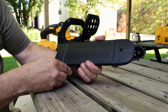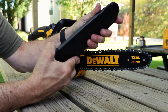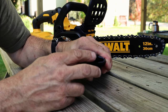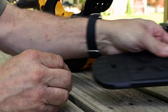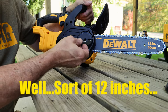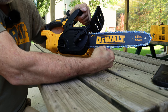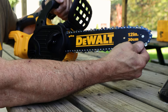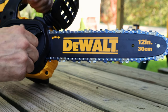The scabbard, as I said earlier, really seems to be made tough. The inside of it, you can see it's ribbed, and I think the ribs are actually to retain it against the bar. You got a 12 inch bar. Here's your chain tensioner. You use this to loosen the bar and this to tighten the chain. What they want is about an eighth of an inch of play. For all intents, that actually doesn't feel too bad right there.